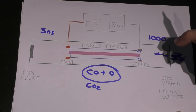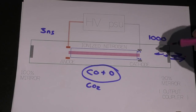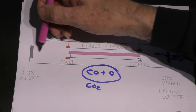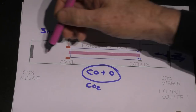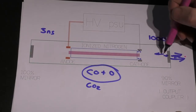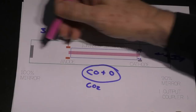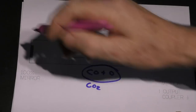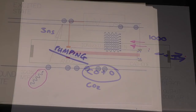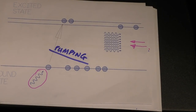A typical 50-60 watt gas tube will be about 1,000 millimeters long from end to end. The speed of light is such that it takes about three billionths of a second for the photons to travel backwards and forwards — three nanoseconds each way — so it's virtually instantaneous. You're now armed with all the information you need to understand how lasing works.